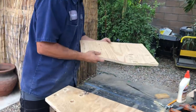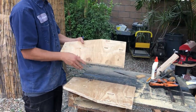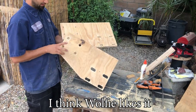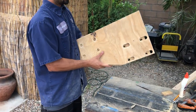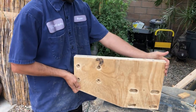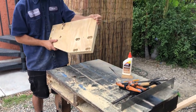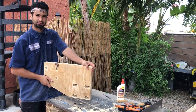I'm going to need it — I need to sound like I know what I'm talking about. So here's our top plate — it's going to mount the actual components to. We've got our slots for adjusting the belt tension and our lower reinforcement plate with oversized slots so we can have washers on the inside to tighten everything down. These are counter-bored so it's got a little more meat to really hold the motor in place. Now we've got them pretty well matched up. I rough-sanded them so they're real close. I'm going to Elmer's glue them together, let them sit, then come back and sand them again. While those are drying I'll cut the legs and get the shelf and shelf braces done.